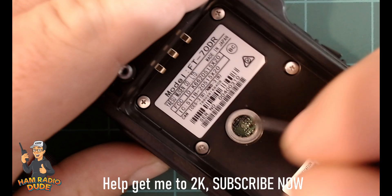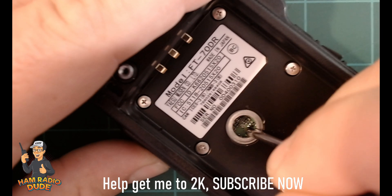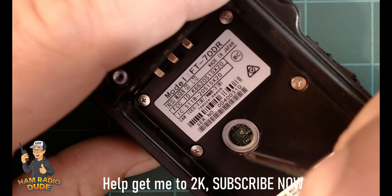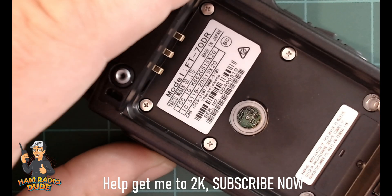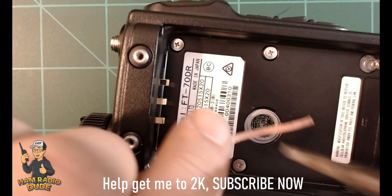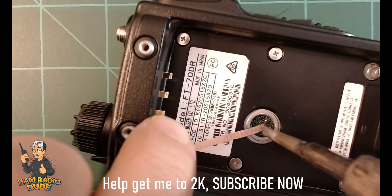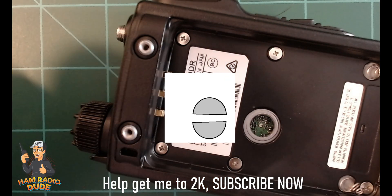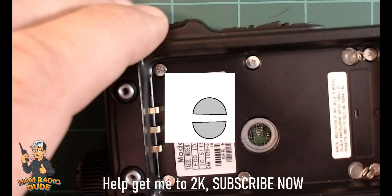The resistor was still on there, so what I ended up doing was — after the solder and that area were heated up — I gently used a screwdriver and rubbed that resistor off, and it came right off with no problems. I then went with the braid and put the braid on top of the solder point. You'll see there are two crescent moons where the solder and the resistor used to be.